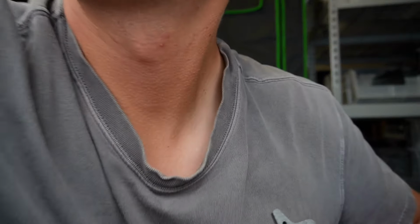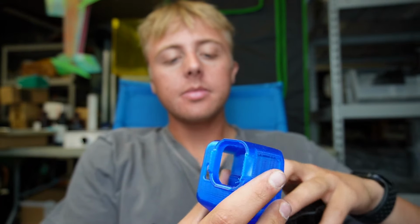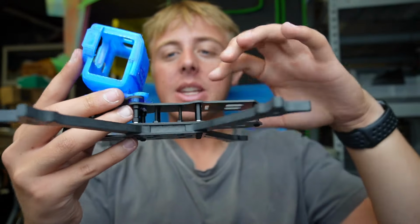One benefit that we've always noticed and known from racing frames is that short standoffs do require maybe a tighter build, but they are far superior as far as durability. They're not going to bend as easy. Your stack and build is just to be more compact and clean anyways to fit in there. And again, your GoPro is going to be up high like so, props out of view, and your battery is going to be super slammed. Toilet tank or hot dog, whatever you want to call it, normal battery mounting is available.